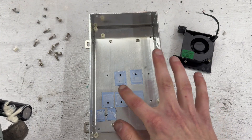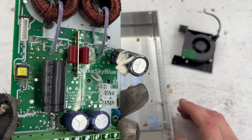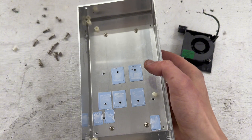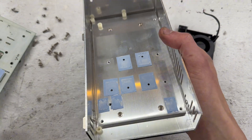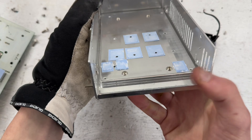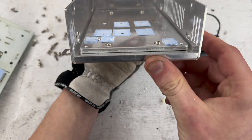I've taken the controller out and we have thermal padding — some of it got stuck on the side. There were screws going through all the MOSFETs just to keep them down. I've seen on YouTube that there are different models of these; this one has a heat sink, whereas others just have thin metal. So this is a better design than previous versions.